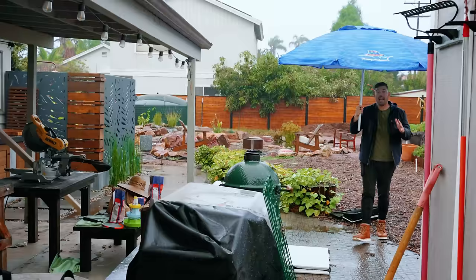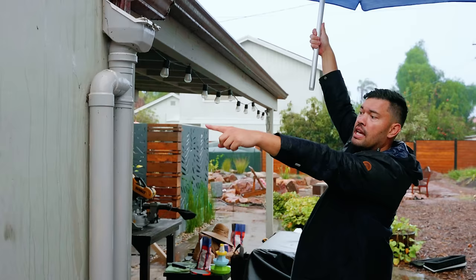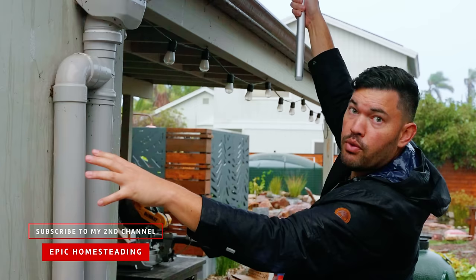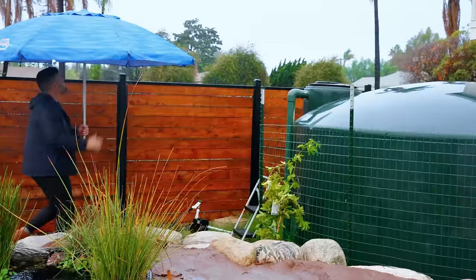My house at the Epic Homestead is almost the perfect case study for rainwater capture — it's about 1,000 square feet of roof space. I have this gutter system dropping, and you can see it active right now, just pouring water from my entire roof into the same filter system I just showed you. But where does this tube go? Once it reaches the first flush level, it drops down into the abyss. This is where gravity-fed rainwater capture systems come into play. As long as the input here is higher than the cistern's input all the way over there, this underground tube will automatically gravity-feed the water in.